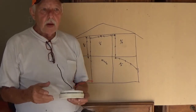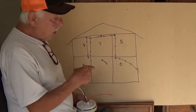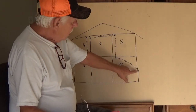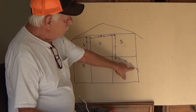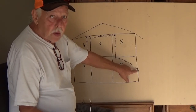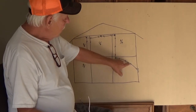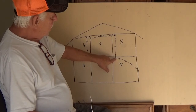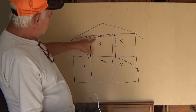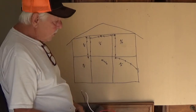What that does is, if you have a fire in any room in the house, let me show you real quick. This is your panel right here. Okay, now the little line has got these X's on it as a circuit. They run that three wire, which, you know, that's what I'm talking about, red, black, and white. You don't count the ground. They'll run it up to a smoke detector, then they'll run it up to another smoke detector, another smoke detector, another smoke detector, another smoke detector. And that's all that's going to be on that circuit.